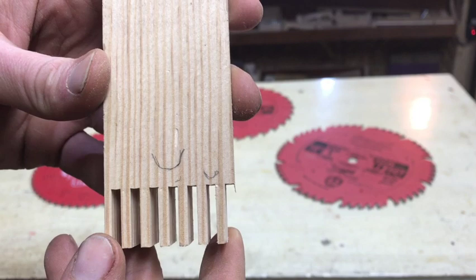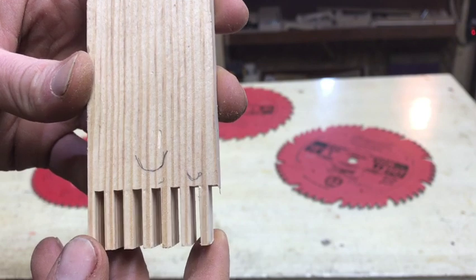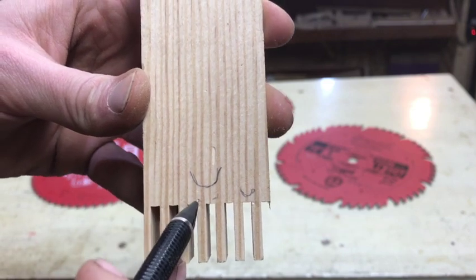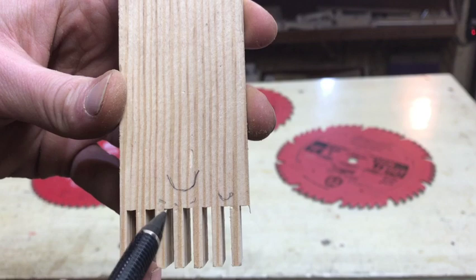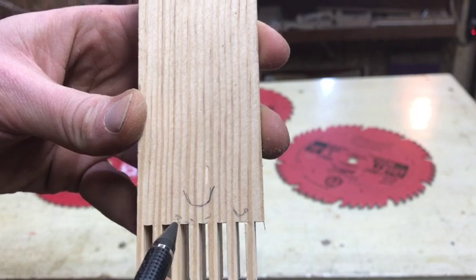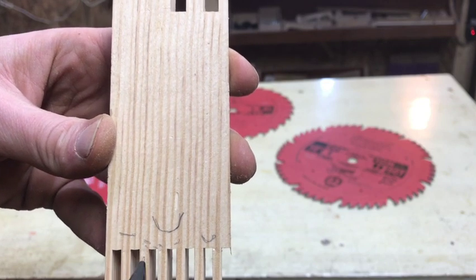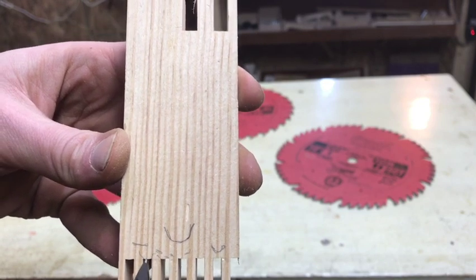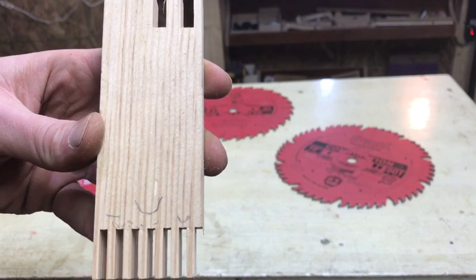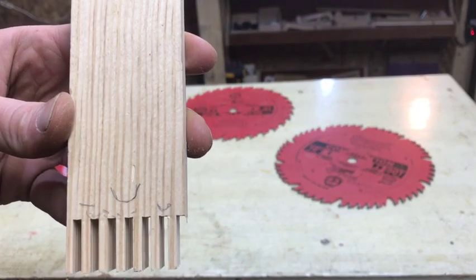I'll show you that now. This piece was cut with a Freud combination blade which has one flat top grind tooth for every five alternating bevel teeth, and you can see this slight U-shape left here with the points being higher. This is not perfectly flat, so when you glue together you will have these slight little gaps in the corner no matter how hard you clamp it. If you want them to totally disappear you need a flat top grind. Alternating tooth bevels will leave an even more severe gap. The combination blade though, as you can see, is very close.